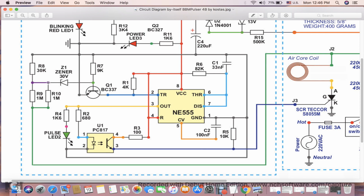At this point here, as soon as we turn the device on and start charging the capacitor bank, voltage will start raising here, and it will get to about 30 volts. After it gets to 30 volts, the Zener will start allowing anything above 30 volts to pass through, and as it passes through, it raises a current on the base of the NPN transistor, and opens up a transistor through this line onto the ground here. So anytime you have voltage raised to about 550 volt, you will have enough current to activate this transistor and basically complete this line between base and collector.